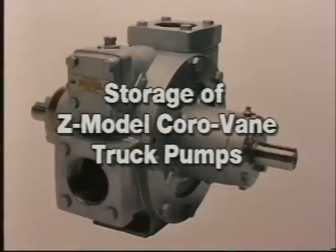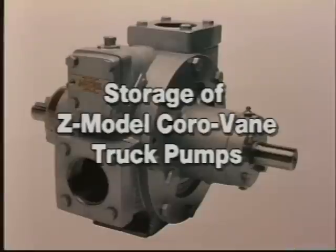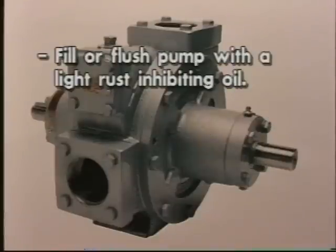Storage of Z-model Coro-Vane truck pumps. If your Corken Z-model pump is to be removed from service for some time, the pump must be protected, as propane, butane, and anhydrous ammonia all leave the metal bare and open to corrosion. Piping and tanks not in service should also be protected, as the rust particles can destroy the pump seals almost immediately after startup. First, fill or thoroughly flush the pump with a light rust-inhibiting oil. If the pump is flushed with oil, placing some desiccant packets inside the pump will provide added protection.